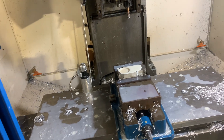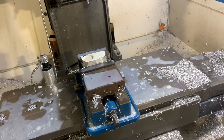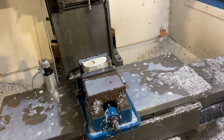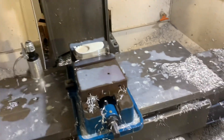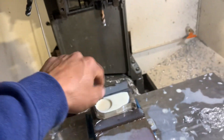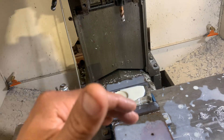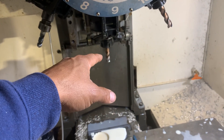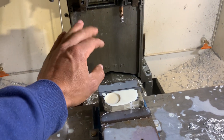The spiral diameter is 100 thousandths and the ramp angle is 5 degrees. I'm mentioning these numbers so that if somebody knows what I'm talking about they can compare with whatever they've done before. So the spiral diameter is 100 thousandths, the angle of the ramp is 5 degrees, running with that half-inch end mill. I already ran it but I went too fast at 100 inches a minute plunging, so I'm going to plunge down at 50.